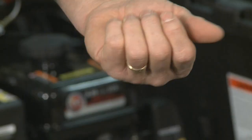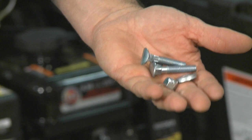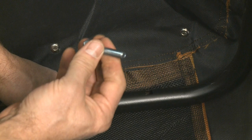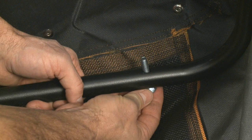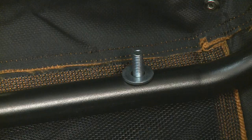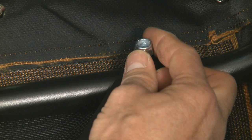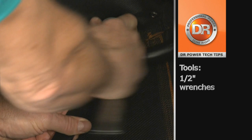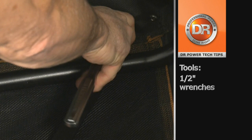I pulled two bolts, flat washers, and lock nuts from the enclosure hardware bag. On the back side of the tube frame, insert one of the shorter bolts from the enclosure hardware package up from the bottom, making sure the curved head fits properly into the tube. Lay a flat washer on top and do the same for the other side. Tighten this down just before it touches the link assembly — we want it as far as we can get it without binding so the link assembly can still rotate. Attach the other end of the link assembly and leave it in the open, unlocked position until later.